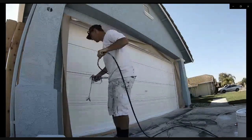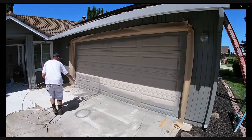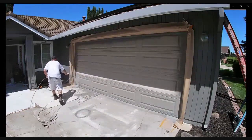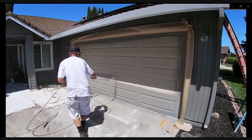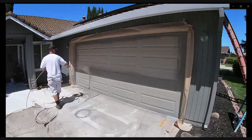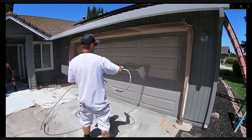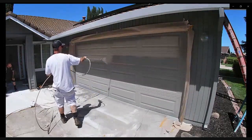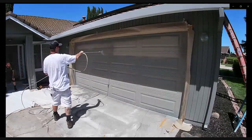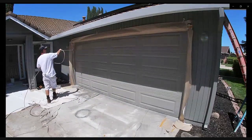One last thing: I used to paint my doors side to side — I would spray side to side because I figured big long strokes would be better. But I've realized, don't do it that way, because you're actually giving yourself lap lines. If you're not familiar with lap lines, it's where you overlap the paint and it either dries light or heavy, so you'll see these lines across the door. Now I know that a vertical spray gives you a better finish and reduces the opportunity to get those lap lines, because you're keeping a wet edge. Doing this long horizontal run, it's drying by the time you come back — it's a very thin layer because you're not spraying too heavy on the metal garage door.